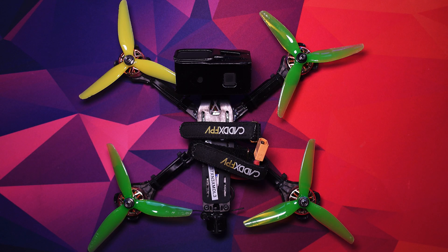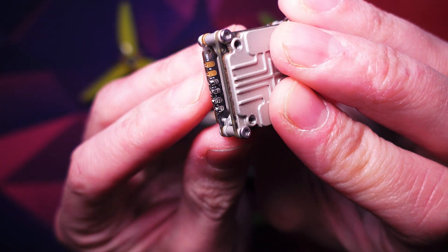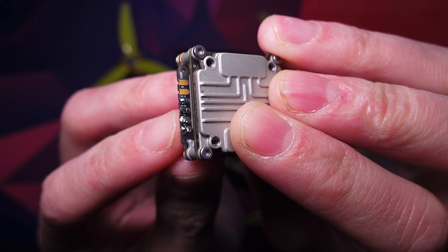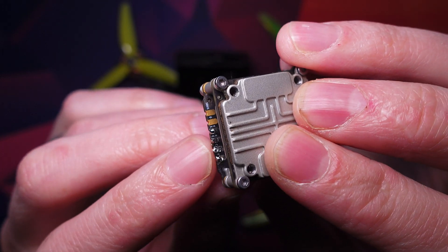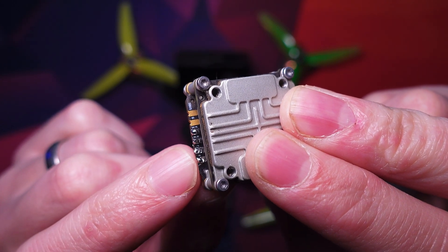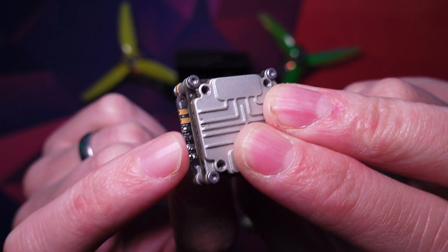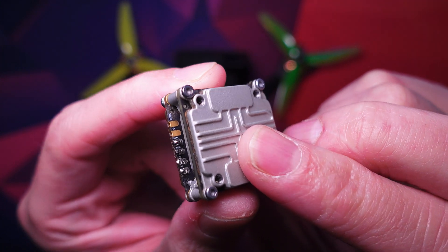There are quite a few reasons why the voltage doesn't work coming out of the Vista. Sometimes there's a diode in there that's blown and that causes it to not work. I'll leave a link in the description below on how to fix it. Quick test is to get a continuity tester and just check those first four pads — the battery, TX and RX. If you do get continuity, that means the diode's blown, at which point you can fix it via the link below.